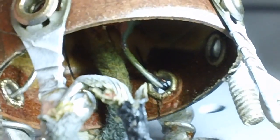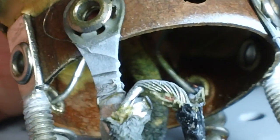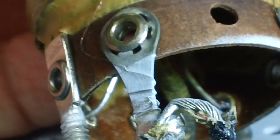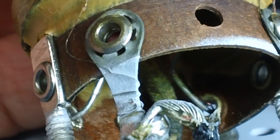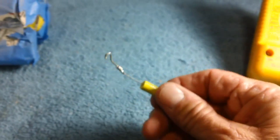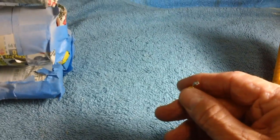I had to desolder a couple of items, but if you look down in there you can see the resistor - the lead on the right and the big thick lead on the left, just to the right of that screw. I can get to both of those with my cutters. I just need to slide it up carefully and leave some of that lead so I can pigtail - the coil method. She's out, and here it is to prove it! I had to disconnect the ground wire and remove that first capacitor I put in to get the slack I needed, but that's nothing - the coil method just slips right off.